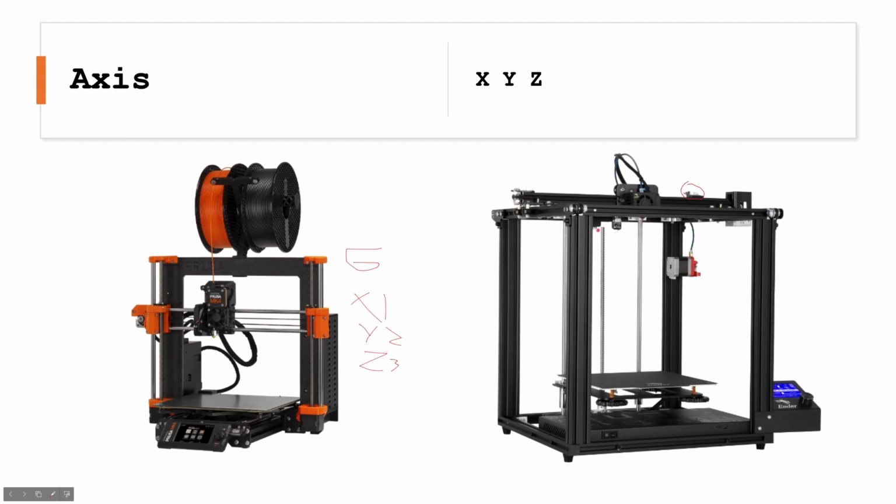It's a stepper motor, which means it moves in tiny little increments. So if you were to skip a step, it means the motor stopped, it tried to move somewhere, it thinks it moved to that place, but it actually didn't. And now your print will be shifted. So a drawing of this would be like this. This is my box, and let's say the X wanted to move to 2, but it couldn't. So now it'll keep printing, and the box will look like this, because it thinks it's here, but it's actually here.